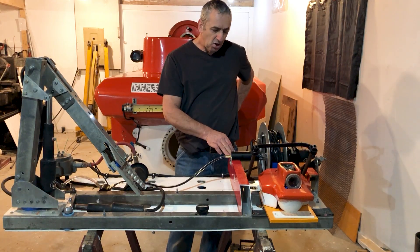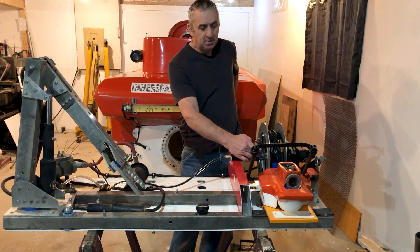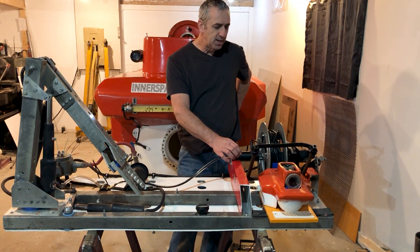Now, full disclosure: I actually bought a small slip ring and then I simply machined a housing for it to allow it to go quite deep underwater. And of course it is oil filled and pressure compensated.